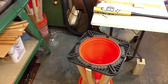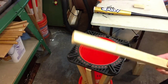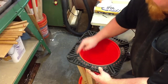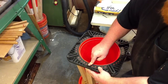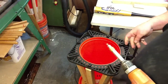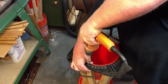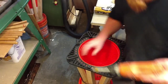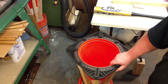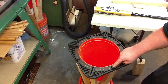Now that I've got the seven supports screwed to the plywood — I'm leaving the eighth one removed — we can install the PVC pipe. But I need to put a screw down in between each one of these rubber feet to hold the top of the wood. Pull it tight and run it through, just like that. Do each of the seven of them — run the screw right down the middle of the rubber, you'll never even see it.